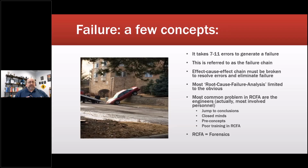So when I arrived and went to the repair shop and looked at the records, I saw that 7 years before, all 4 of these DC machines had basically stalled for several minutes, and were getting full current on the armature. I looked through the records again and wondered, is it possible that they didn't replace the commutators, which they had not? I knew they had annealed the bars in the commutator, so that was going to be part of the issue. We identified the problem pretty quickly.